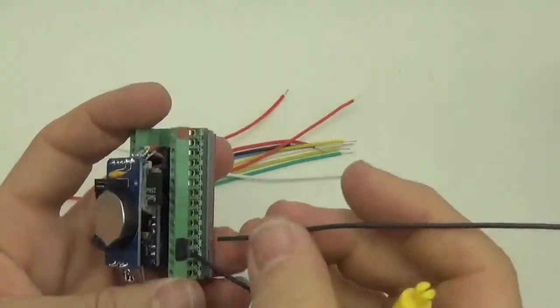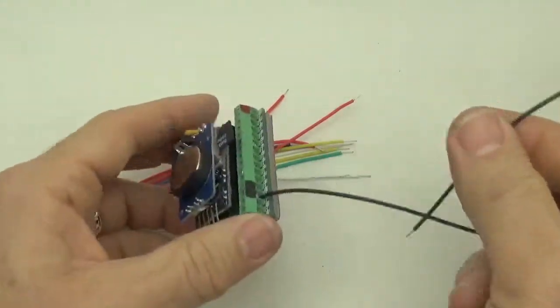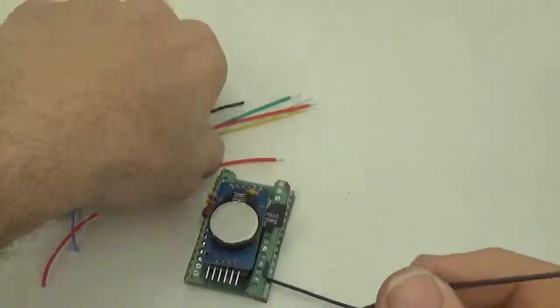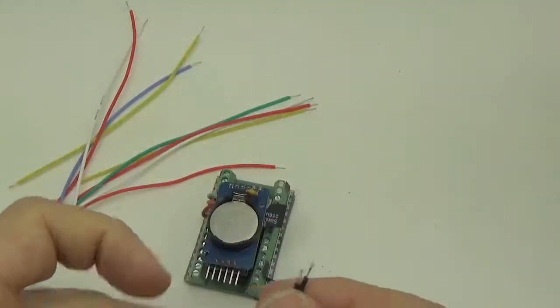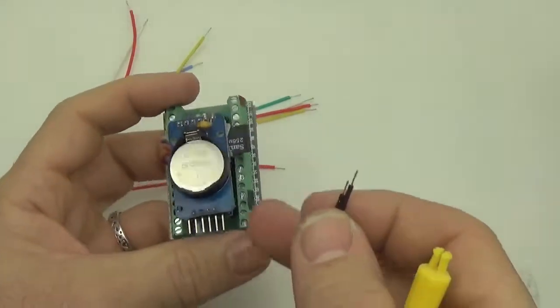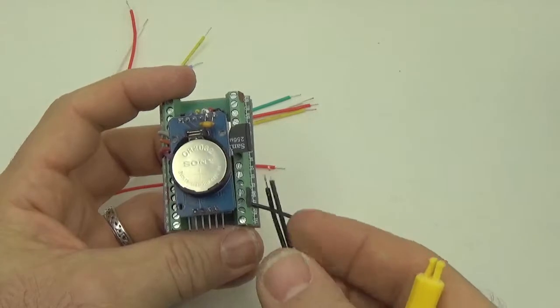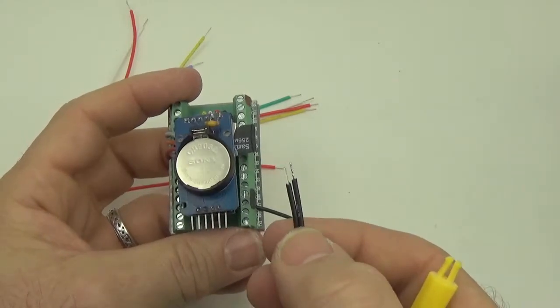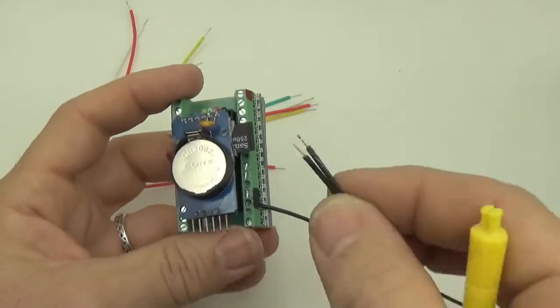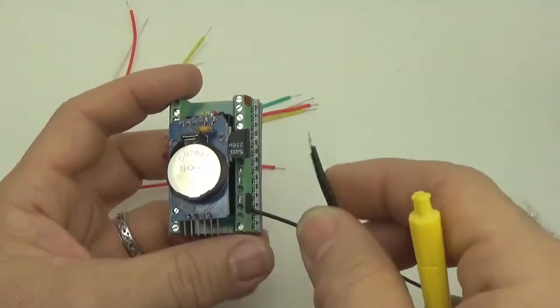Do you have to tin the wires before you put them in? No, that's a really good question, actually. I used to tin the wires before putting them in, but what I found was that they slowly compressed, and so the solder held the wires together in a thicker package, and then over time the pressure from these little screw terminals flattened them out, and they actually became loose.